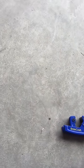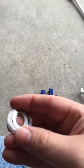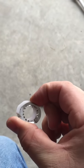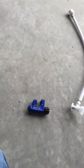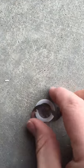Once you get this piece off, what's gonna be left is this — the shark bite, or shark mouth, or whatever they call it. This is what's holding everything on, what's digging into that line and keeping you from pulling it off. It looks about like this — you've got two metal clips sandwiching a white washer.